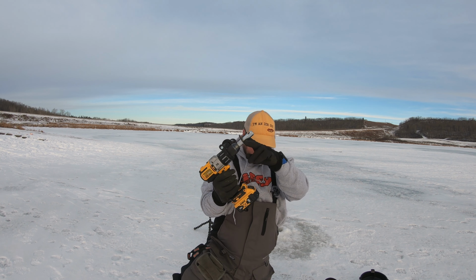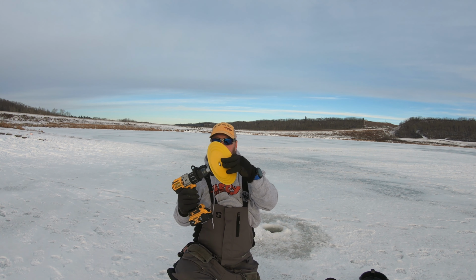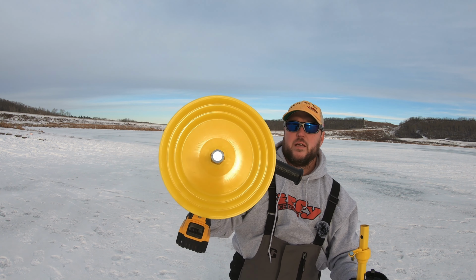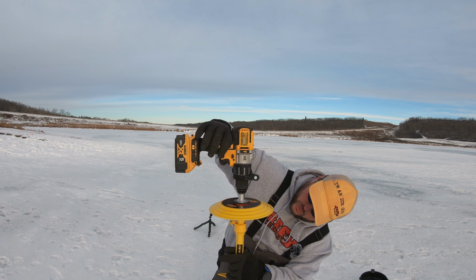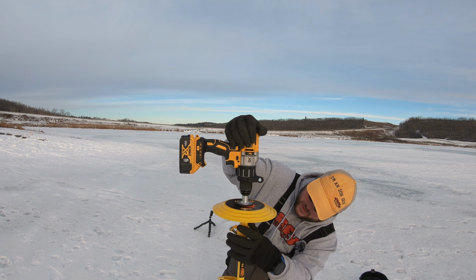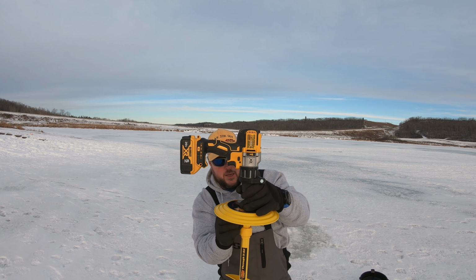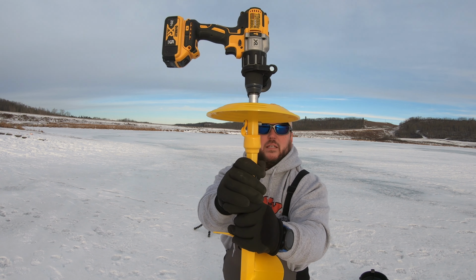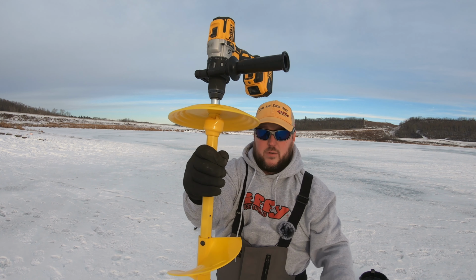There's a washer on here. Keep that there. Take the disc. Slide the disc on. It's just a round hole, so nothing special there. But now, I'm not sure if you'll see this, there's a little bit of a hex pattern around the circle there. That's gonna fit the hex shaft on here. So line up your holes and then twist the disc to get those lined up. And then slide your pin through, get your pin through all the way. She's all the way through there, you can see that. And then you just take and slide this over top, give it a little twist, and she ain't going anywhere.